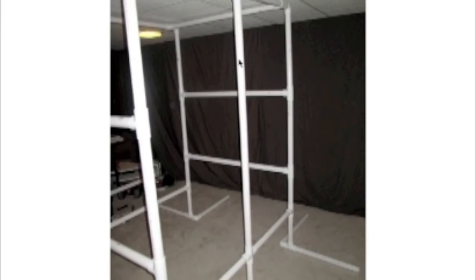And then you're back up at the top, just above the section that we were just working on. And then you're going to put your 2-foot section into a T with the hole pointed down, and then into another 2-foot section. Then your final piece, this is a 5-foot 3.5-inch beam going down, and right into that last section.